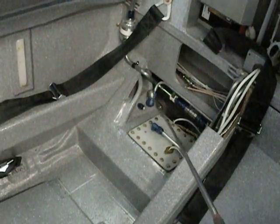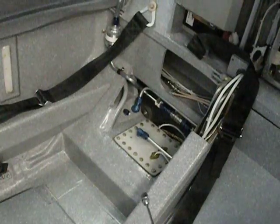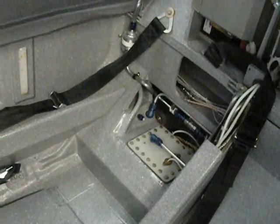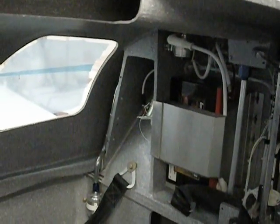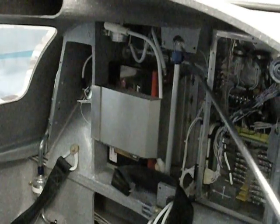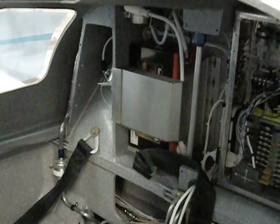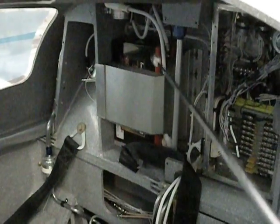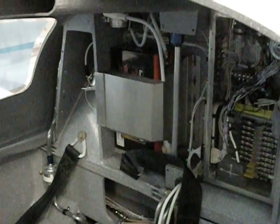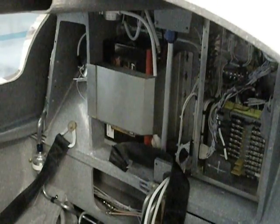Here I have a vent pipe running across here. Right underneath there's a T-section which then feeds up to this pipe running right up here, and then there's a box which is a plenum area where all the vents come together from the wing tanks. Anything comes up towards this box, and we either feed down there or get air bubbles coming up from the tank below. This box up here has a feed right to the front and then back, and vents out through the bottom of the fuselage. That's the vent system.